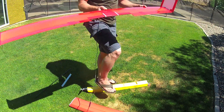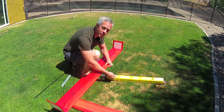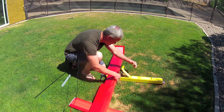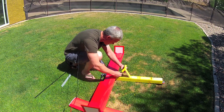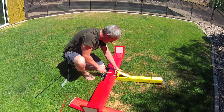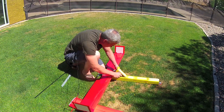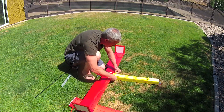Same with this side. So now the main wing is ready for mounting. The rubber bands stay with the fuselage — I like to put two right against the fuselage as friction for the wing mount, and then the remaining rubber bands hang out inside. The wing is placed centered against the motor mount, and then around the arrow shaft which protrudes rearward. The receiver is just attached and placed back in.